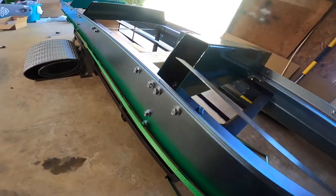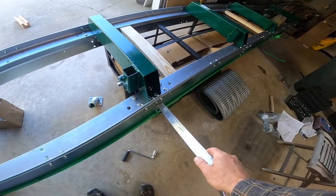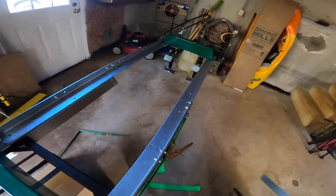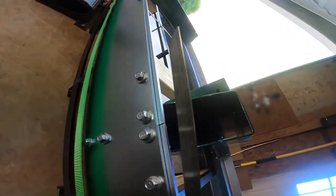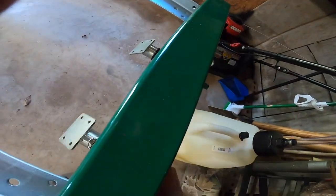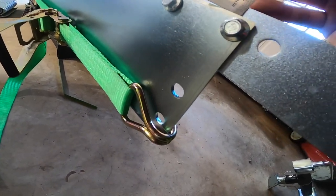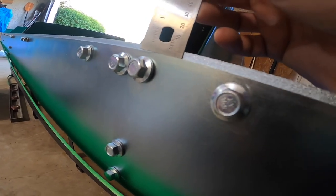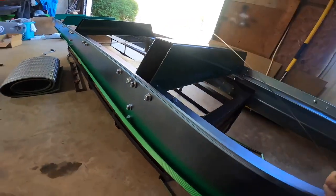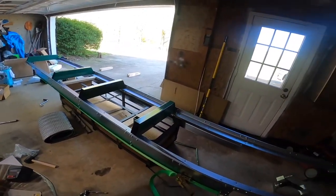This rail has a bow to it. To get that reveal right, I had to put one of these jacks because it was lower here - I raised it up. Since we've got a higher reveal on this end, I'm going to jack this end up to raise it and kick this down to get that same reveal. I've got the two end bolts tightened, but it's sagging in one spot, so I'm going to lower the jack at the end and then jack it up right here to raise that reveal. It's a little meticulous but really not too bad.